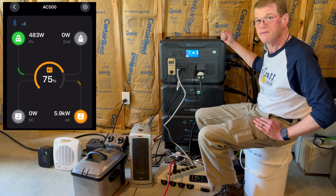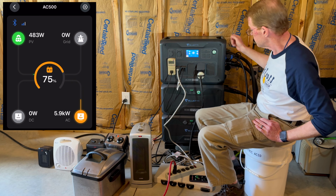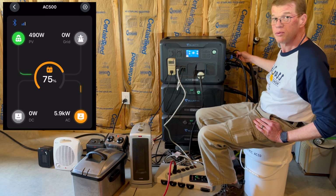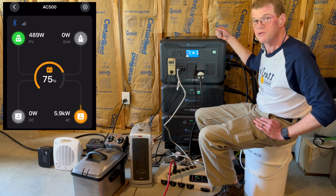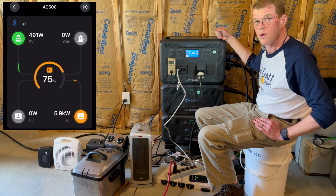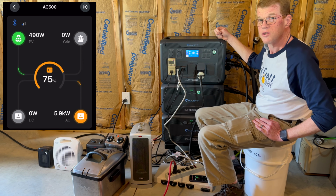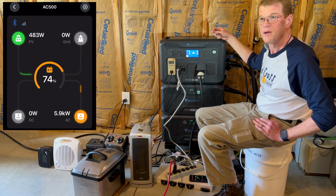Also, the AC500 will draw up to 3,000 watts from solar. It still uses the same solar input cord, but it will now take 15 amps from the solar array instead of 12. So you get 1,500 watts per solar input, two inputs, 3,000 watts total. The AC300 would only draw 12 amps off of each input for a total of 1,200 watts